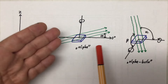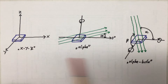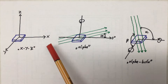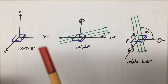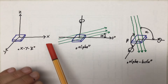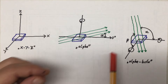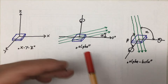Back to the regular program — that is the promised content. We already talked in the basics video about how that chip can deliver several kinds of magnetic measurements. First, our chip can measure the magnetic strength of the field in three axes, giving you the X, Y, and Z component of the field — nothing new there, we saw that in other 3D magnetometers. Second, it can measure the rotation of a magnetic field around an axis and give you an angle alpha — also nothing new, we saw other chips do the same.